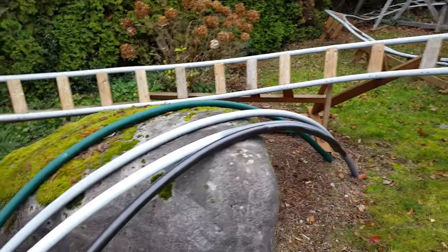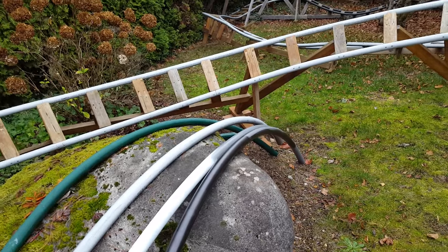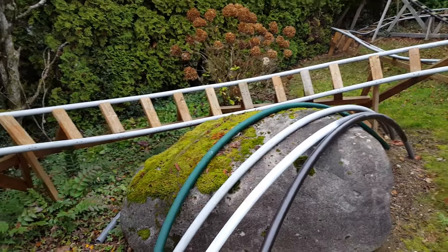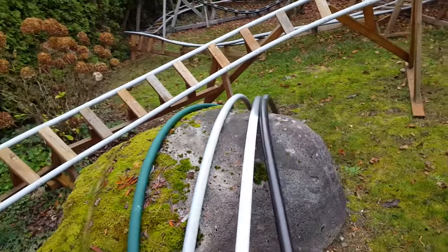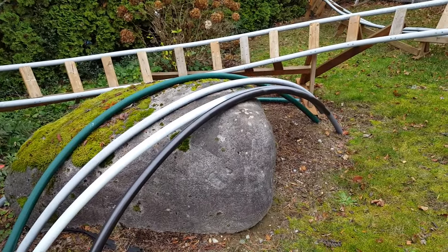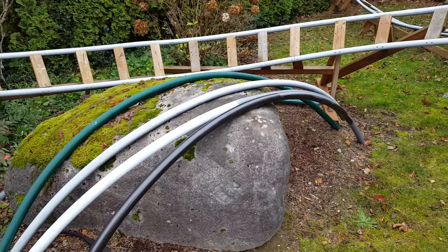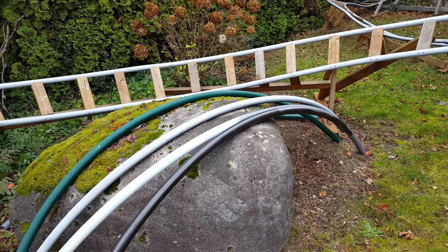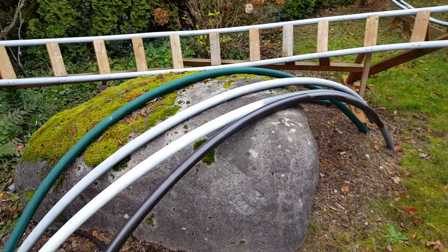These pipes on this rack are sun-conditioned. I know that's maybe not so smart in Seattle, but we know that PVC pipe embrittles in sunlight. I never use white PVC, but the gray conduit Schedule 40 PVC has sunlight resistance noted on it because it's used on roofs and the sides of buildings. My solution is to paint them soon after I formed the pipes with hot sand internally, and I think that will provide a lot of ultraviolet resistance to impact failures later on.